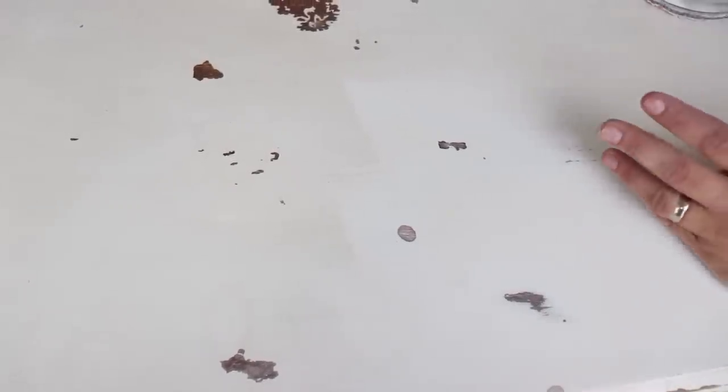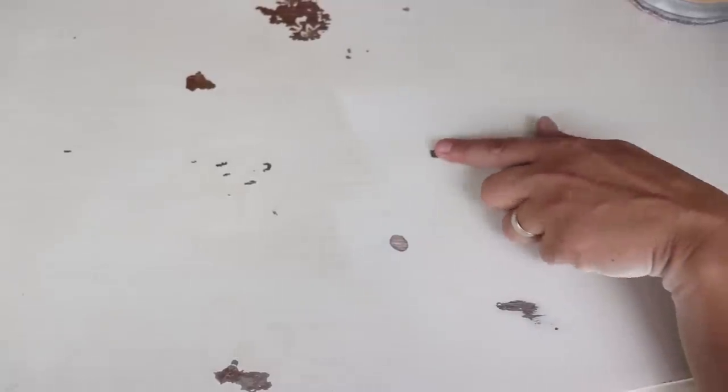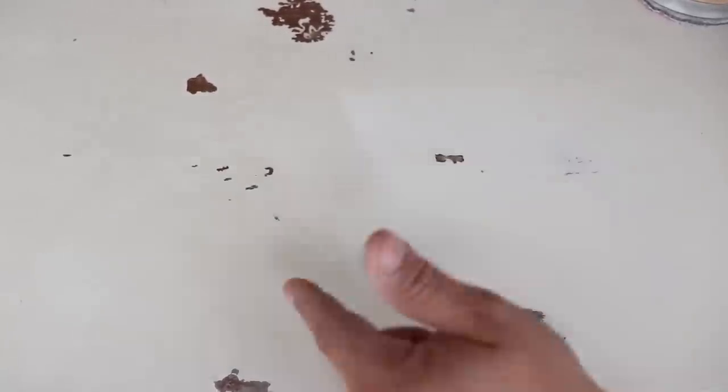When I'm all done sanding, I will actually scrub the whole thing. And it looks like it's got a little bit of bleed-through happening that was underneath the dirt. So instead of sealing this with a liquid sealer, I'll give this a nice coat of wax so we don't get any additional bleed-through.